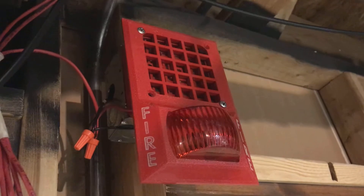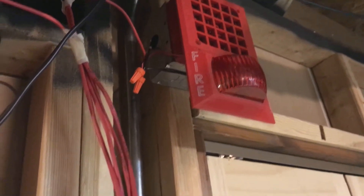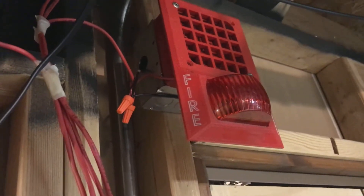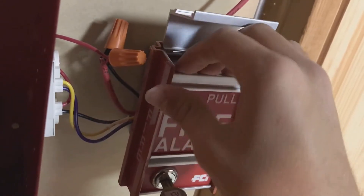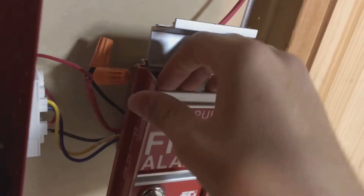No point in setting that off. I figured, since I've got the MS-2 and the older horn and strobe plate, why not go ahead and set it off kind of the similar way to an older system. So the horn is doing continuous, the strobe is just going to strobe and do its thing. Because if I remember correctly, this is a strobe, not an incandescent bulb. So we'll go ahead and do the older FCI MS-2 pull station, which is a dual action lift and pull.